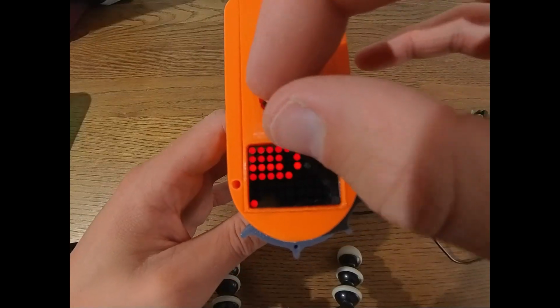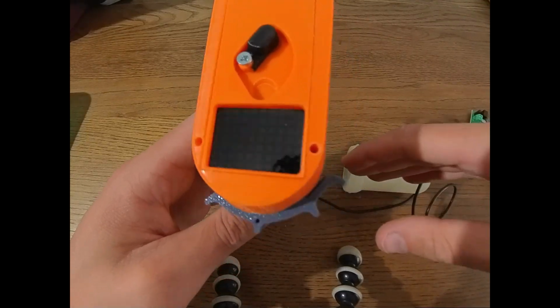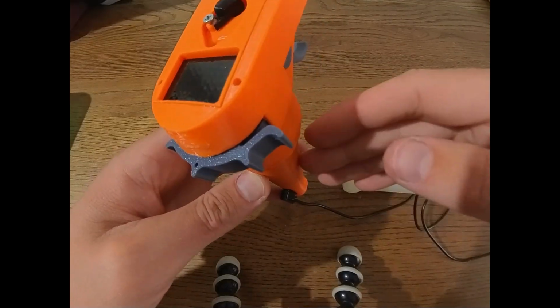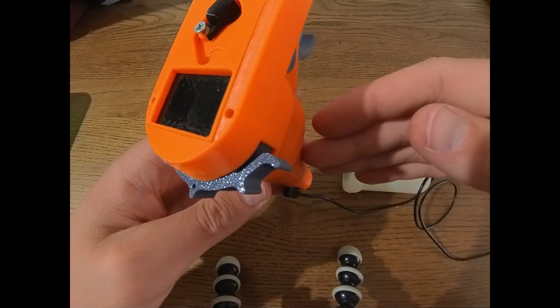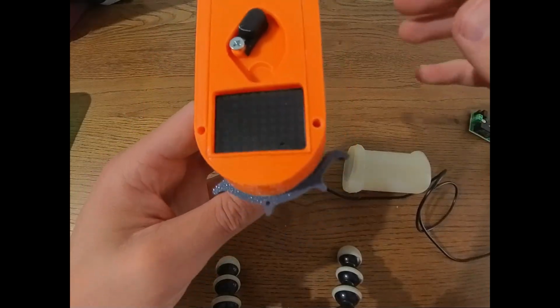What I would recommend is when you charge to turn off the remote again after you saw the screen and just let it charge. This way the charging will be a little bit faster. Overall, the charging on a very empty battery will take about 10 hours plus minus, and that will give you a few tens of hours of ride time on the water.